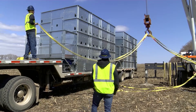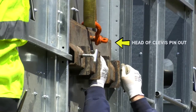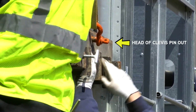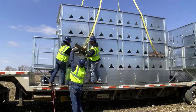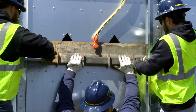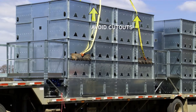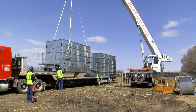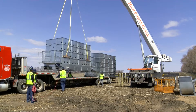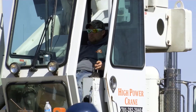Using the lifting techniques laid out in sections 4.1 and 4.2, attach the lifting brackets to the tub section. Make sure the head of the pin is to the outside of the bracket so it won't interfere with the sidewall of the dryer. Best practice would be to use a spreader bar, but if you are using long enough straps, make sure to use strap protectors and to avoid the cutouts in the top of the section. Failure to do so may cause the strap to get cut under tension and cause the dryer to fall, risking injury and or death.